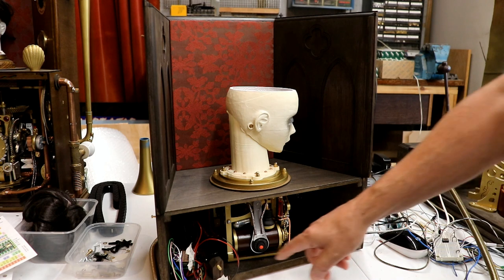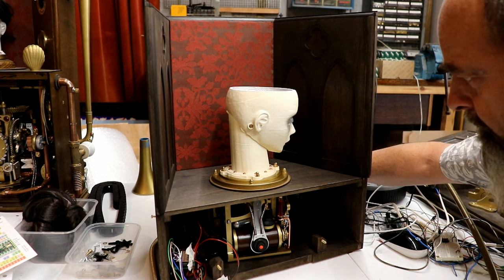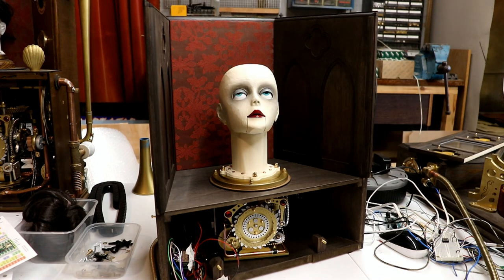Right, it's a little bit of a struggle to get that pin in. Let's try this now. Well, that's not bad, is it? I'm sure I remember in the past, when I set up Victoria originally, that she kept fluttering, or as the Arduino started up, all the servos would be going backwards and forwards, but that isn't a problem this time. That's fantastic. Connecting them up or attaching them over to the pins and then immediately setting them to 90 degrees. That seems to be working really well.